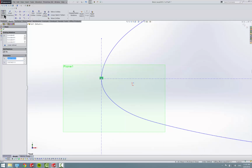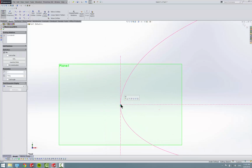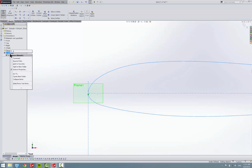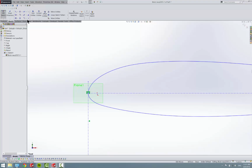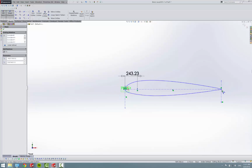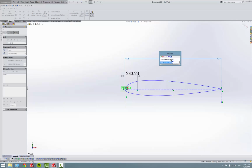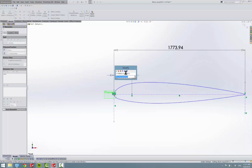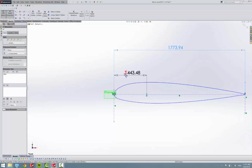Go ahead and leave that in free space and then put this point there. Actually, just kidding. We want to put the spar along the quarter chord, which I imagine is where they put it, because most airfoils have their center of lift on the quarter chord. The quarter chord is just 0.25 times the length of the chord, which our length is supposed to be 5.82 feet, I believe. Yep. Okay, so let's come in and make equals 0.25 star this. And that puts us exactly at the quarter chord.